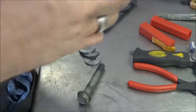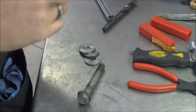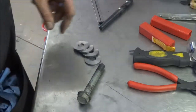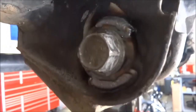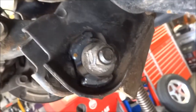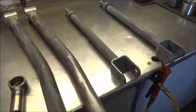If you put a chamfer in on each side you might reduce the support area from 125 thousandths down to only 50, 60, or 70 thousandths — not what you want on a structural spacer like this, even if you'd normally chamfer a big bracket for cosmetics. I've put a bead top and bottom — total probably about half the circumference — nice and solid. I'll pull that out, touch up the paint, and install the lower control arms.